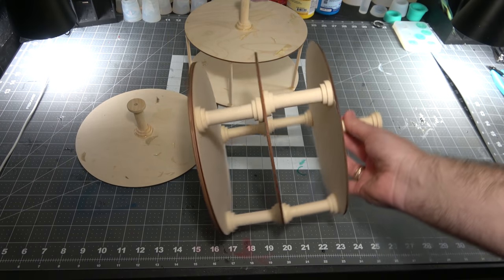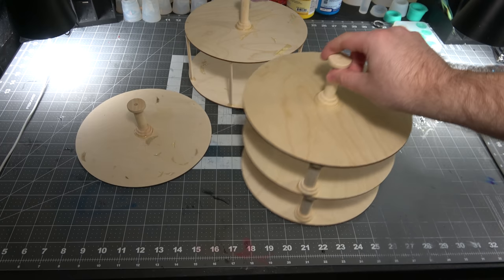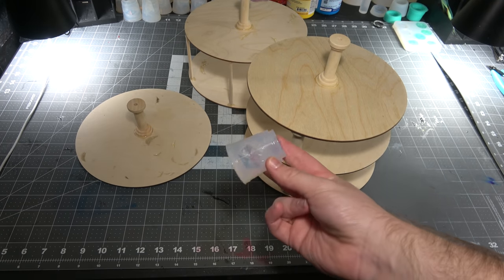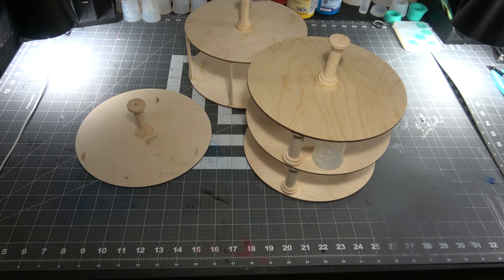You might have seen on the inside of the vessel it's pretty domed, so I've created little platforms with nine-inch diameter wooden circles and wooden dowels from the dollar store. It's great for setting molds on top of so that you don't have to worry about getting resin down inside your pressure pot, and it sets everything flat. I have a one, two, and three-tiered version. The two-tier is four inches in between, and the three-tiered is three inches in between, so I can fit more molds in there at a time without having to worry about overcrowding just one platform.